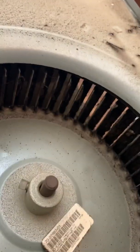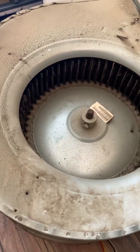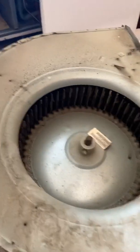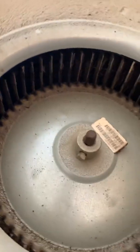This thing is just not gonna do the job, so I'm gonna take it apart, get a new one, slap it back in, clean the blower wheel a little bit, and get them up and running. Check this out — dirty as all hell, and that's due to never changing that filter.